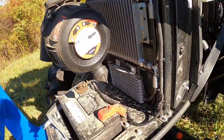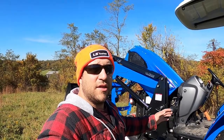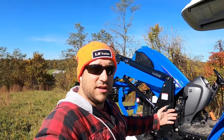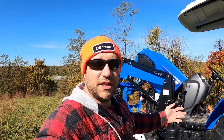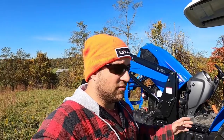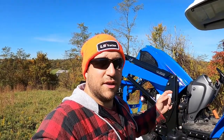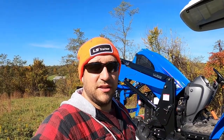And I'm going to talk to you a little bit about that. All right, so like I said, it's 73.5 horsepower. And I asked them, do I need to add DEF fluid anywhere? And they told me, no, it's not needed until you get to 75 horsepower. And for some reason, I thought it was 55 and above, but that's why they stopped at 73.5 horsepower. That way you don't have to add any DEF fluid.